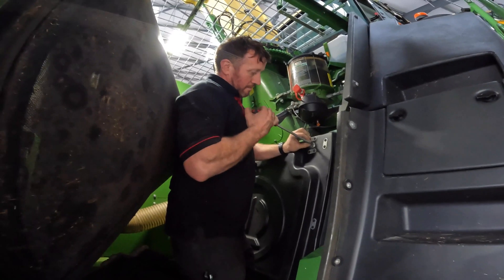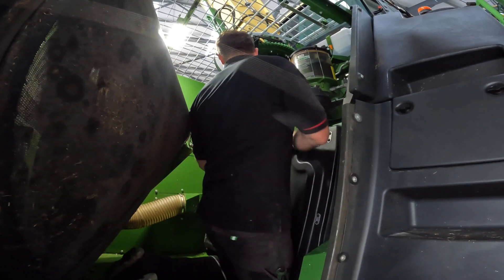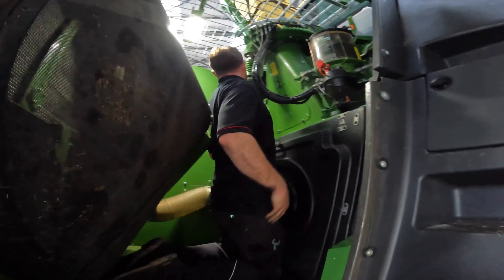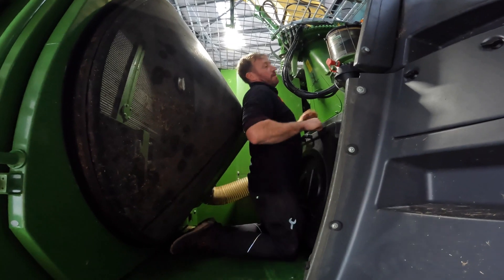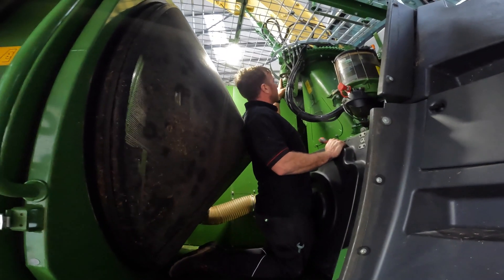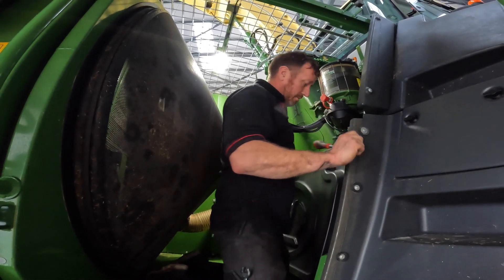This is really a dust cover — it's to keep the air clean that the rotor screen is sucking in, because it would take the dust from the ground otherwise. You can also see this big spring here — that's for a breakaway on the spout, in case you clipped anything: a pole, tree, whatever.